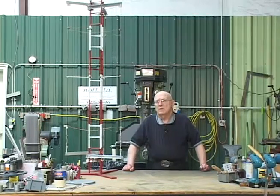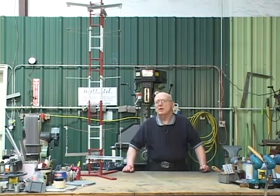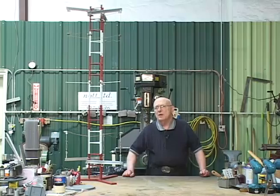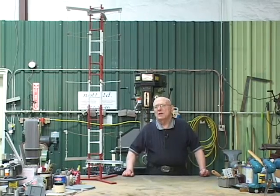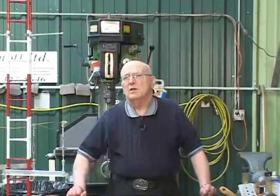They found this antenna had two advantages. One was broad bandwidth, much better than a single-wire dipole. The other advantage was that back at that time, coaxial cable was not easily available to amateur radio operators, so they made their own open wire, called ladder wire transmission line, which is of much higher impedance. The folded dipole presented about a 300-ohm impedance at its input, which they could easily match with open wire ladder line.